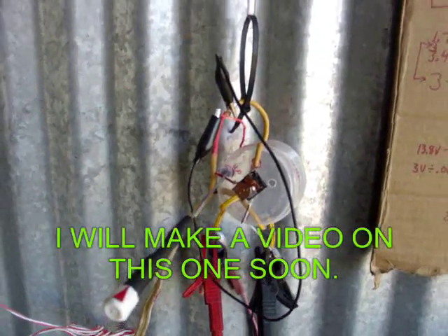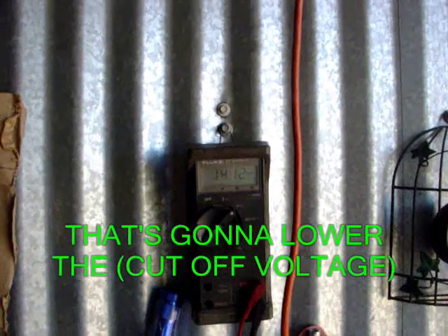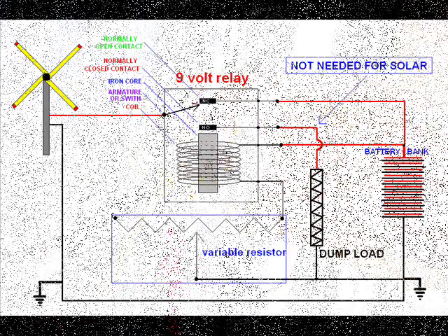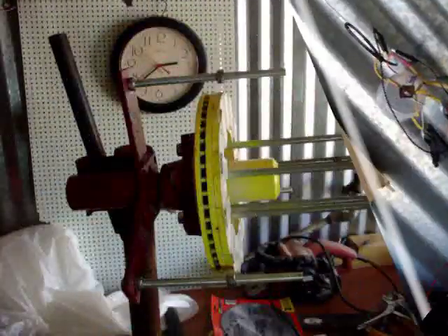We're looking at 14.12 volts. The charge controller has got the screwdriver already set in it — I turned it up a little high to fine tune it. When this gets to 14.2, I'm going to turn the screwdriver to the right instead of the left and that's going to lower the voltage. The instant this one goes to around 21 volts, I'll know it's open voltage and that this relay has just turned. The reset on this is just taking this clip off and clipping it back on. A 15-turn variable resistor right here in series with the coil. You shim right up underneath the magnet — the electromagnet comes up and you put a shim on top of that to get it further away from the magnet.